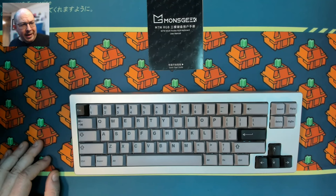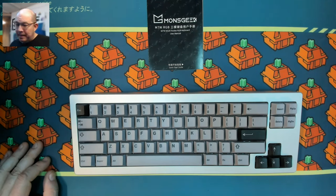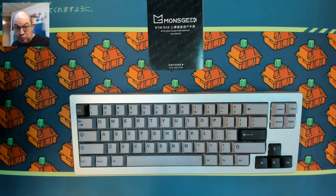I will put a link down below. I got this on Amazon, but I didn't look all that hard. I do want to find 1 mil PET because I think that will allow the switch to just punch on through on its own. Though there is another material that I found that most people will have in their house that basically creates the same effect as the PET plastic. It's plastic, but it's not PET, but it's similar enough. I will show that to you when I do the comparisons, as I'm going to do one with the household plastic that you would normally find, and then with the PET sheet, so you can hear the difference between stock, this other material, and PET material.